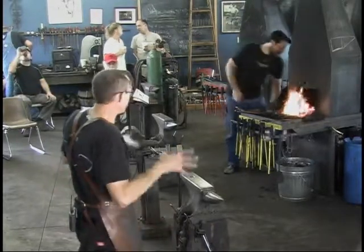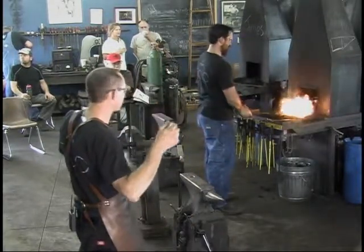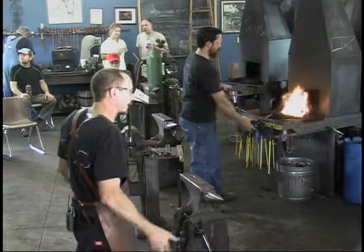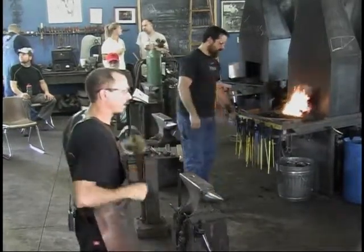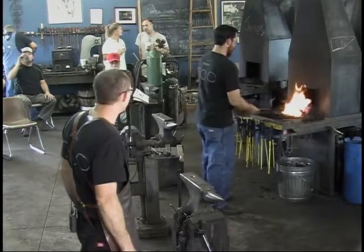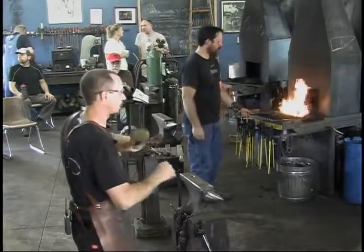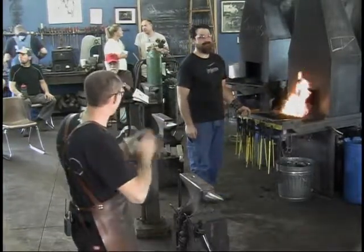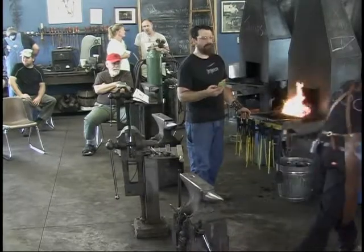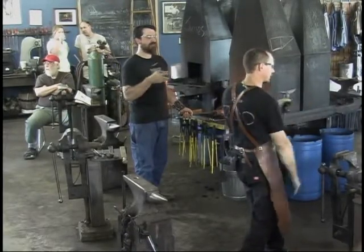But normally, at this point, when the forging is all done, heat it back real nice and hot. Bright, really bright orange, around 1800 degrees, and put it in vermiculite overnight. Let it cool down. When you take it out, you can file away. A nice coarse bastard file will cut the stuff. It's really easy to do, real simple. For me, it's a pleasure filing on these things and getting them down nice. I file the round horn to shape. The square one, if the forging's nice on the side, all I do is grind the top. When the forging is done, I look to have it either flat, or maybe raised up a little in the middle, so that I can then sand that top smooth.